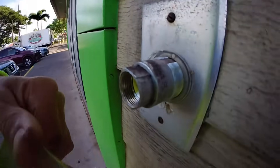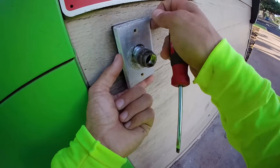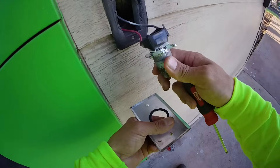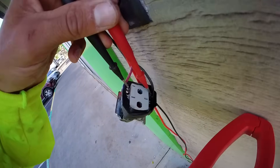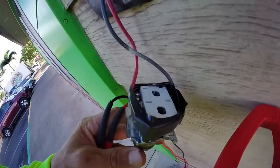I'm going to try not to create chaos here. This is my first time doing one of these. What I would expect here would be a normally closed contact that when it's open produces an alarm. But it looks to me like this side has 120 volts and this side doesn't, so it would be a normally open contact that shuts down the pumps. I found a little 120 breaker in the panel that's an emergency stop. I held my breath, turned it off, hoping it wouldn't turn the pumps off. Because it's a normally open switch, I just don't know where that 120 gets sent to. I've opened up a couple of things but we seem to be good — people are still pumping their gas. So I'm going to check and make sure there's no voltage in that switch and then we'll put on the new switch.